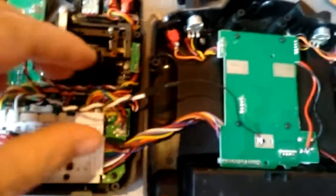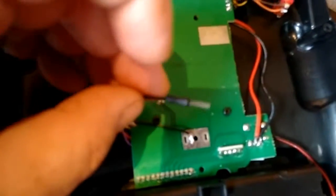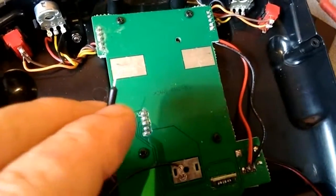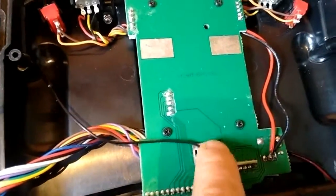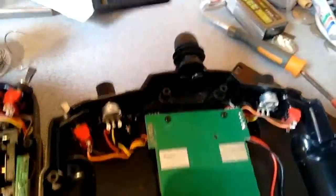What I'm showing you — let's just get down to it. I have quickly soldered on a male breadboard pin — it used to be male at both ends — which I have from some Arduino gear. If you don't have any of these lying around, there are many other ways to do this particular modification. So, pin 5 ends up on this old antenna pad down here — pin 5 out of the module bay on the other side, pin 5 for your XJT module.